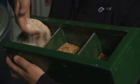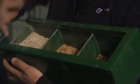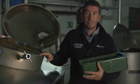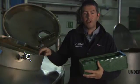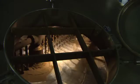The grist from the mill will take about five and a half tonnes to give us one mash in this vessel here. This is the lauter tun, and the mashing process is split into five stages. In the first stage, we mix the grist with the water from the Culbride Reservoir. The temperature they mix at is crucial to gain maximum extract — 63.5 degrees Celsius.